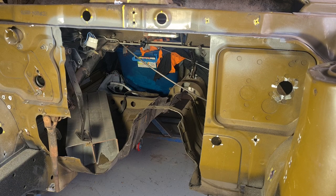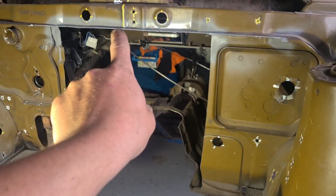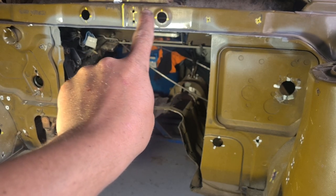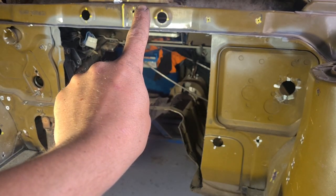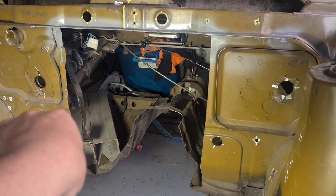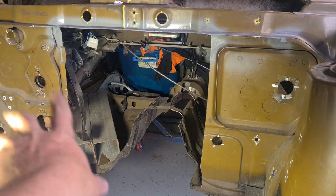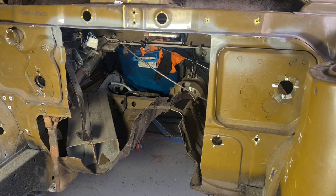That's a much cleaner cut now. Across the top is actually three layers — now two because I've taken one off. This section just out of shot is actually reasonably rusty, not all the way through but it's close, so I'm probably going to have to take that off anyway. I've drilled all the way through each of those three layers so I can weld from the top when I go to put the firewall back in. As for this section, it may end up smaller or bigger — I'm not sure. But for now I have room for an engine, so let's get on to that.